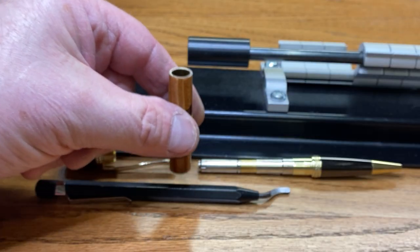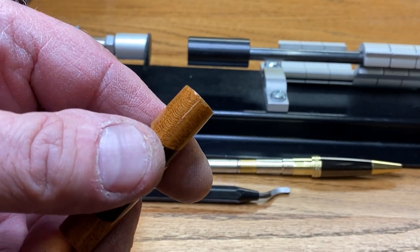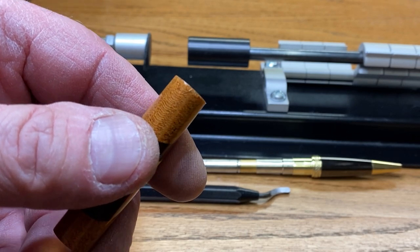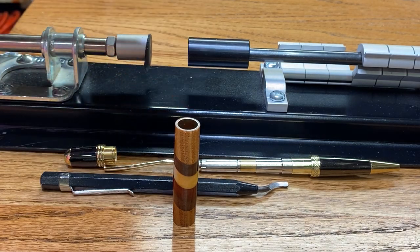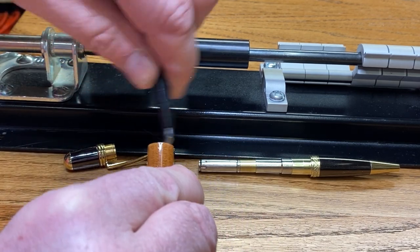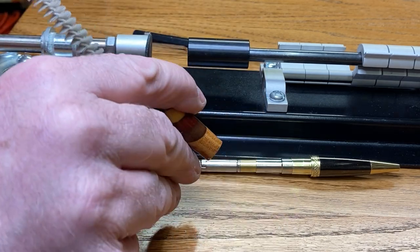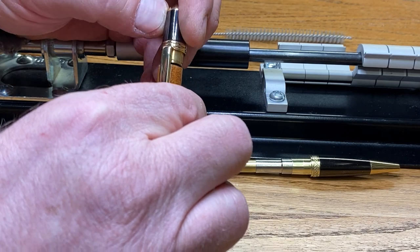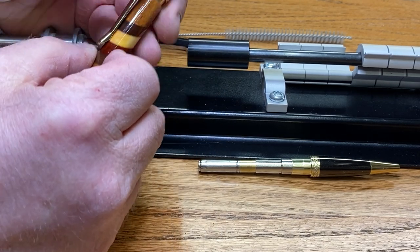You might remember when I turned this blank that there was a crack in the blank. You can see it right there at the end of the blank — it's just so faint, it really blended in well. I actually had a hard time finding it. What we want to do is make sure the clip covers that little spot. I'm going to take this little tool here and chamfer the inside of the blank. We'll run our barrel brush through it just to make sure we get all of those little brass filings out of there. And I'm going to lay the clip right over top of that little spot, and it is completely covered — you will not see it.